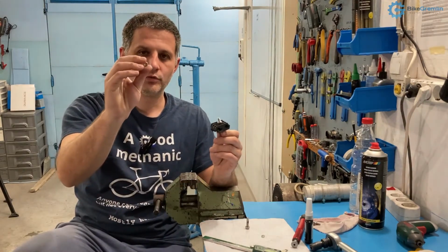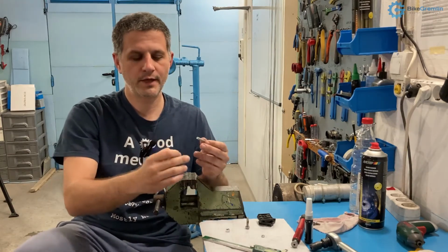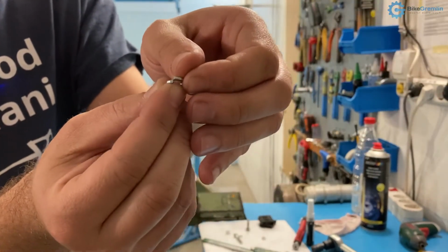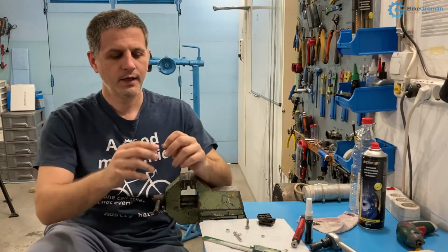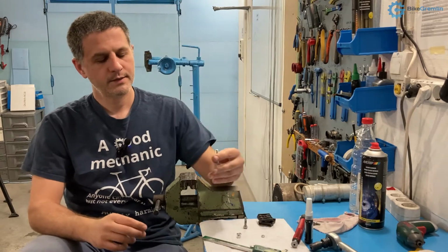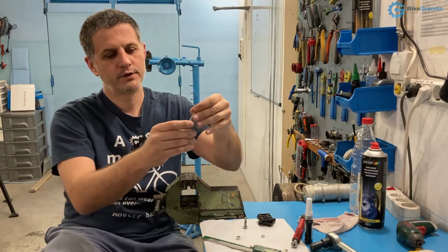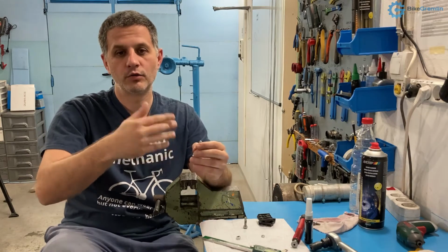If I am not able to do this, for example, I'm using a bolt that goes directly into something, so I don't have a nut on the other end, then I use one of these cutout washers or spring washers, I'm not sure what the name is. They have this spring that you compress when you tighten the bolt, and that does two things. First, these ends bite into the material to prevent things from unscrewing, and they provide some extra preload. So if I cannot use one of these nuts, then I put one of these washers, and for aluminum or carbon frames or other softer materials that are not steel, I put a simple flat washer after the split washer to prevent the split washer from creating any cuts in aluminum, which is relatively soft, or in carbon fiber, God forbid.